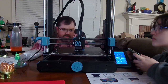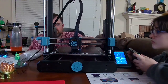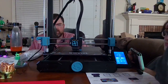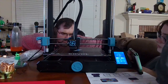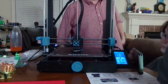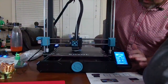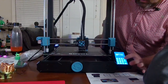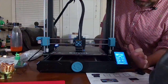And this is all default settings in Cura. And whenever it prints something flat like this, I like to put my finger on it to see if it's smooth or if it's rough, because that tells me exactly how high my nozzle is. And judging, it may need the heat turned up just a tad. So I'm going to go to the heat where it's at 185 by default temperature, and I'm going to put it on 191. Enter.